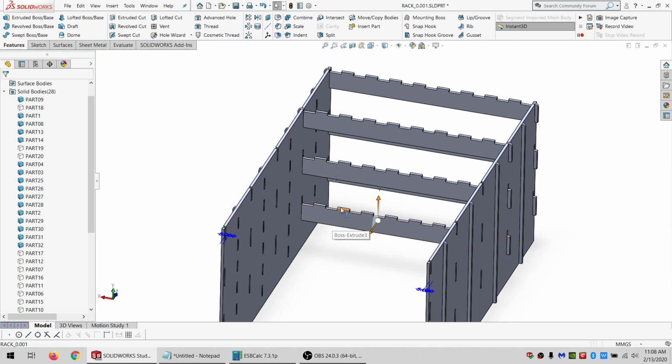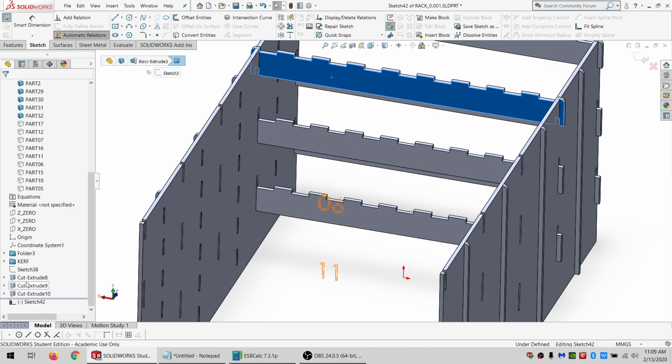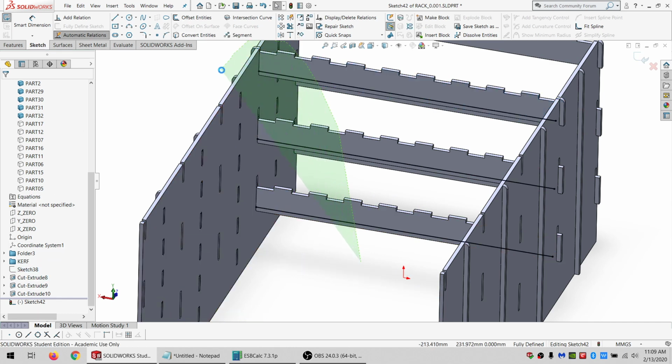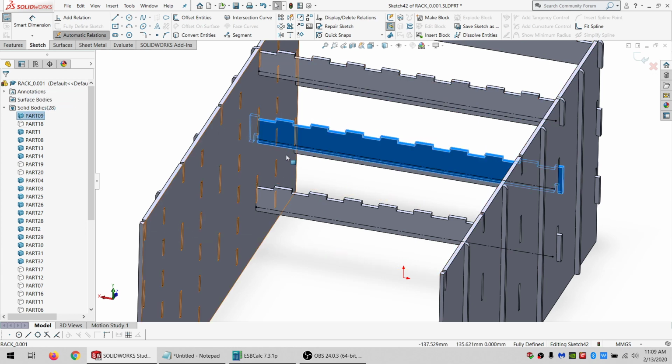it easier to do the kerf if there's nothing inside, because if you just offset the outside and do extrude, it buries everything that's in the middle, which is not a big deal if there's nothing in the middle. But if there is something in the middle, then you have to do a convert first, and that basically doubles the number of lines you're dealing with, and doubling the lines seems to make it take 4 times as long, or thereabouts. I haven't actually tested the exact time, but it's definitely more than twice as long for twice as many lines.